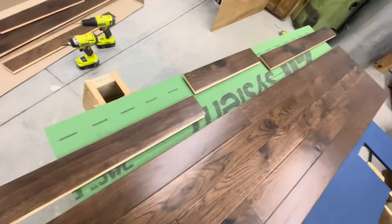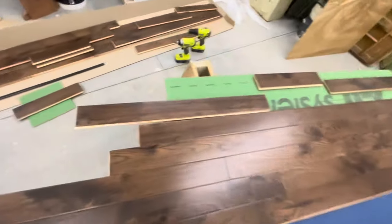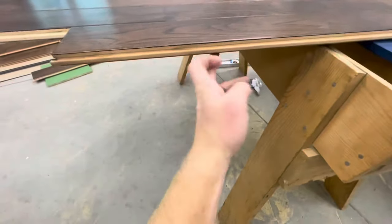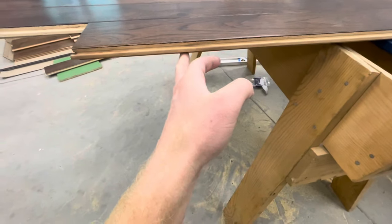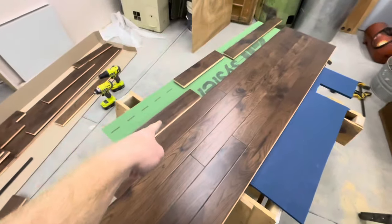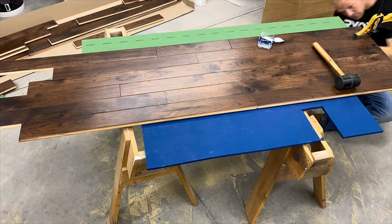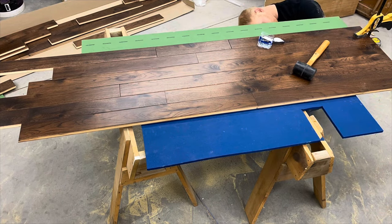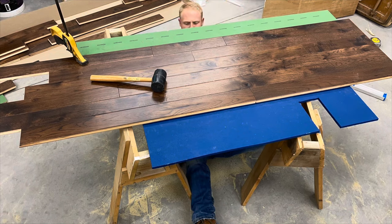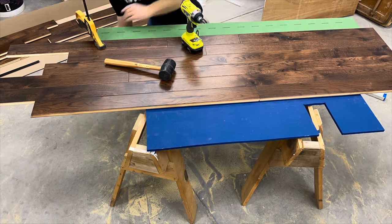This row right here is going to be my last row. Then I'll cut off this excess here. You might be able to see this is where the board stops — we'll have two inches over, so all of this will be excess and we'll use that excess up here for the next two rows. I'm attaching the final row before I cut off my excess, repeating the same steps as before. I'm not going to be able to use all the cutoff pieces simply because of how the tongue and groove system works, but I'll be able to choose a few starter pieces for my last two rows.